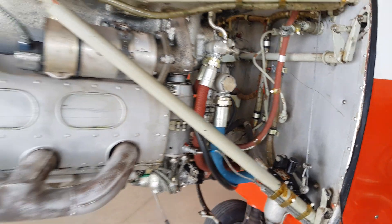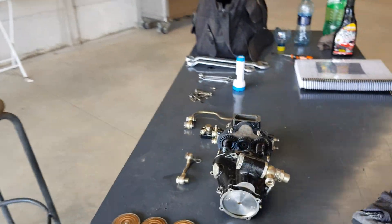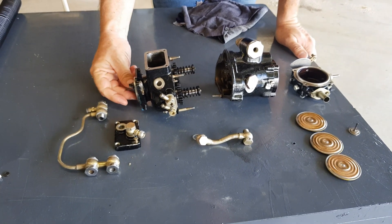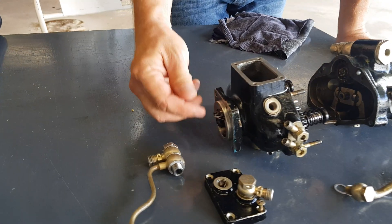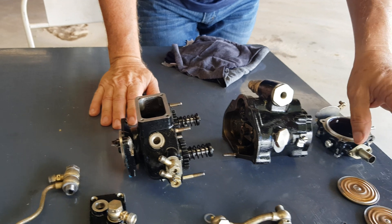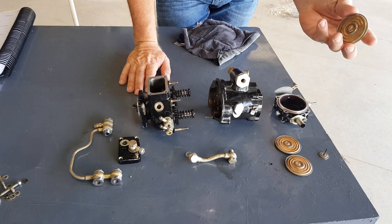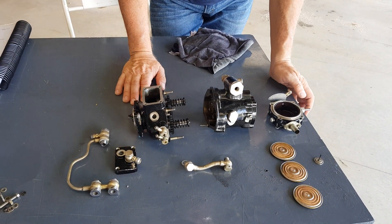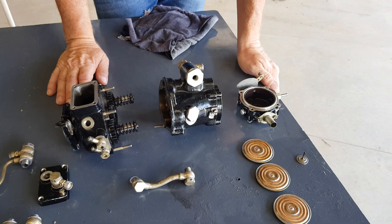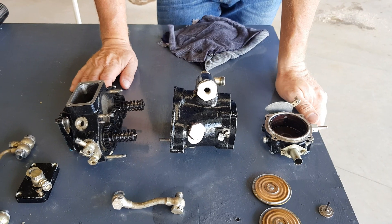So we can now take a closer look at the pump itself. I have here one — this is the fuel pump. It attaches here on the engine. Here is the drive, which makes the whole pump work. But it actually starts here with the aneroids. This is the automatic altitude adjustment that this engine makes by itself. These aneroids are inside here, the aneroid housing, and this has an axle in the middle which makes the proper adjustment for altitude.